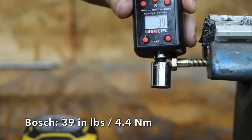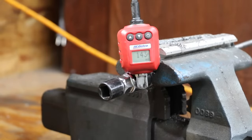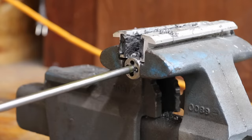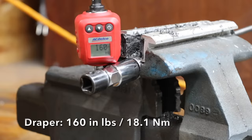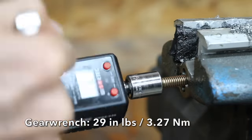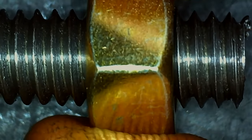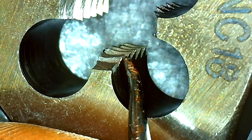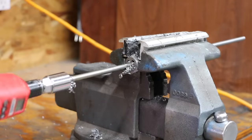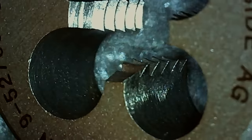It took 39 inch-pounds to thread the bolt with the Bosch die, and the Bosch removed the zinc coating. The Bosch survived the entire test with a peak torque of 143 inch-pounds, but has 4.13 millimeters of side-to-side movement and some damage to the die. The Draper survived the test with a peak torque of 160 inch-pounds. Unfortunately the nut is pretty loose on the threads, though the die is in pretty good shape with only a small amount of dulling to the leading edge of the flutes. The Gear Wrench die was threaded in at 29 inch-pounds, and the Gear Wrench survived the entire test with a peak torque of only 111 inch-pounds—the least amount of torque yet—with side-to-side movement of 2.25 millimeters. The die is still in really good shape. It took 19 inch-pounds to thread the bolt into the Craftsman die. The Craftsman survived the entire test at only 110 inch-pounds, with 2.1 millimeters of side-to-side movement. The die is still in really good shape.